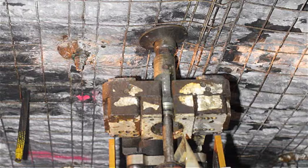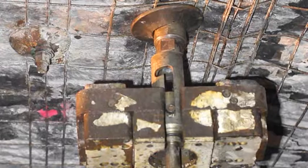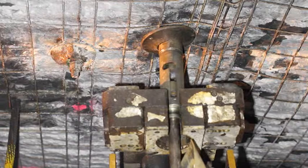After set time, release the feed force on the dolly and rotate the drill motor slightly in the opposite direction to allow the inner hex drive to drop into the body of the combo dolly. Raise the combo dolly so that the outer hex drive can engage the nut of the Megaflex. Start drill rotation and tighten the nut until the drill motor stalls.